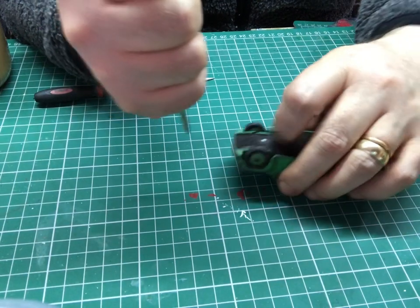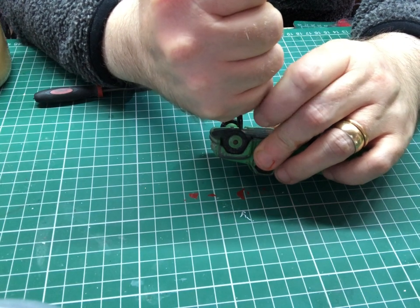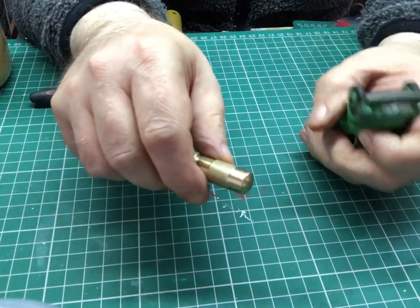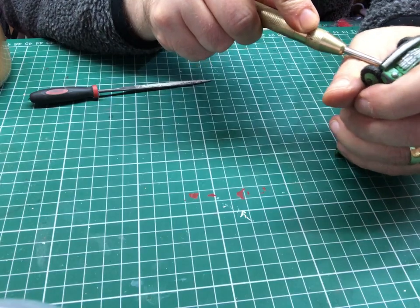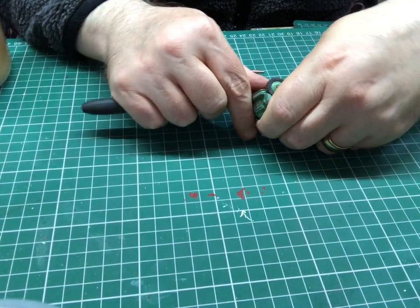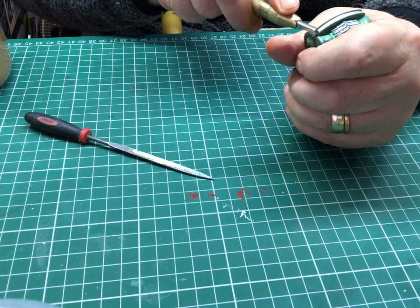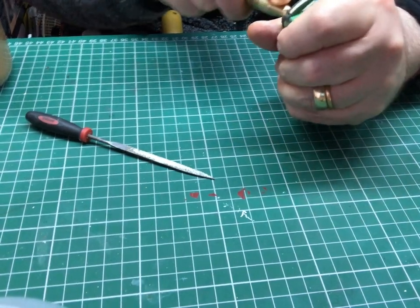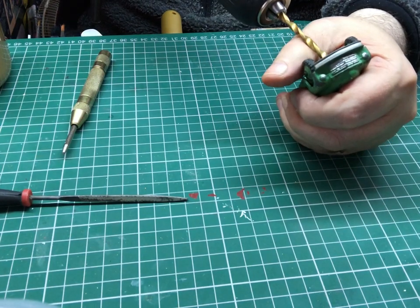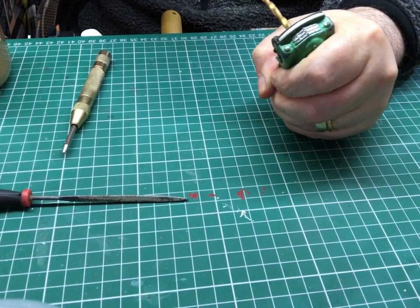So there's one punched in. Let's line it up. It's a bit tough — see if I'm getting a better angle. A little bit more file required there, not gone down enough. There we go. Let's get the drill on it. It doesn't really take much, just a little tiny bit — just take the heads off the posts, rivets, whatever you want to call them, the mushrooms.